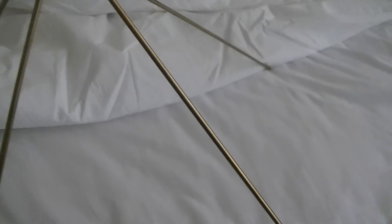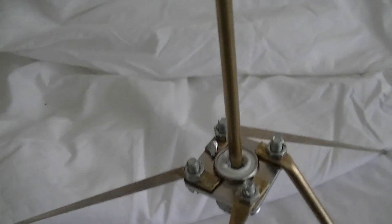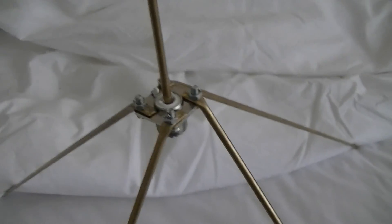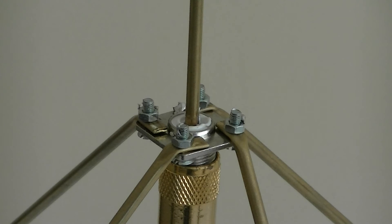817, half a watt into a repeater that's 20-30 miles away indoors — go figure. Right, here it is. I made the ground plane antenna and tried it first with aluminium — that didn't work. I had to compress it in a vice and they weren't working — it was taking too long to get the antenna elements to compress so I could drill through them and have them hold. So I gave up on using aluminium, went back to the hardware store — B&Q here in the UK — and got some nice brass antenna-style tubing. These are 4mm thick, priced about £5 or so. These are much more malleable, you can compress them much more easily than aluminium.